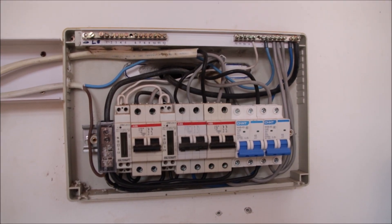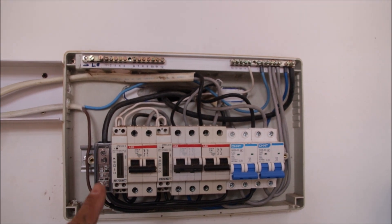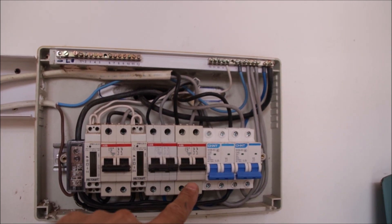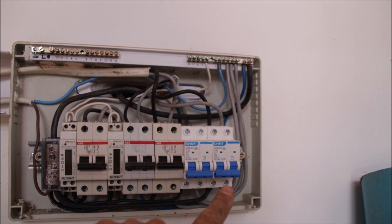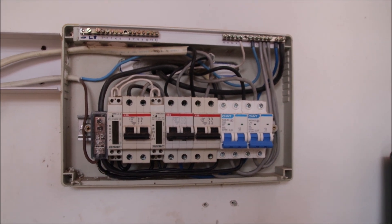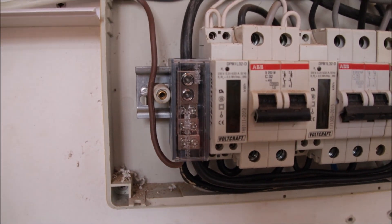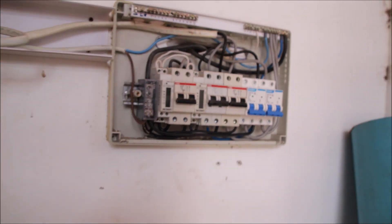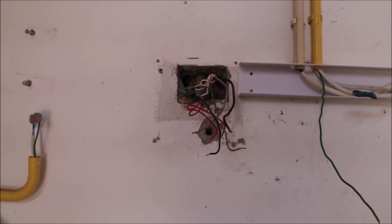I have now finished the distribution. We have several breakers: number one is still the apartment, then the laundry, then the EV charger moved into this box, and then we have the inverter AC in and the transfer switch grid in. Everything is now connected initially to a terminal — there is no more hot terminal bus anywhere in this box.